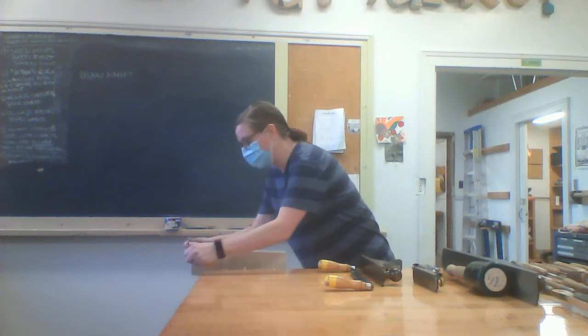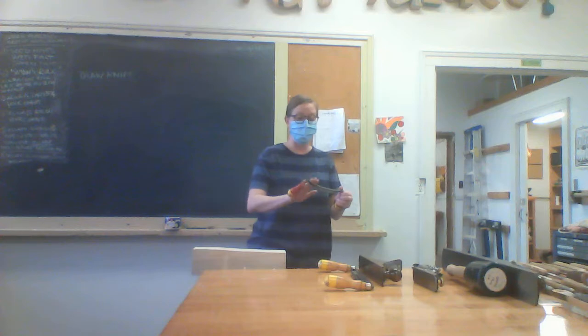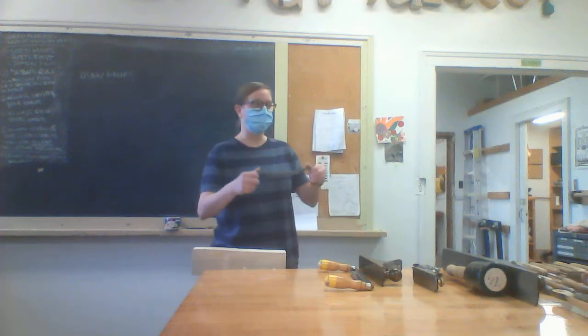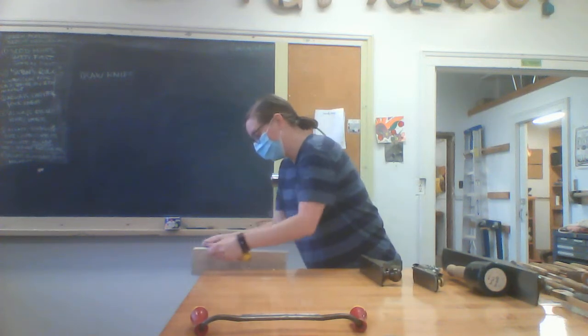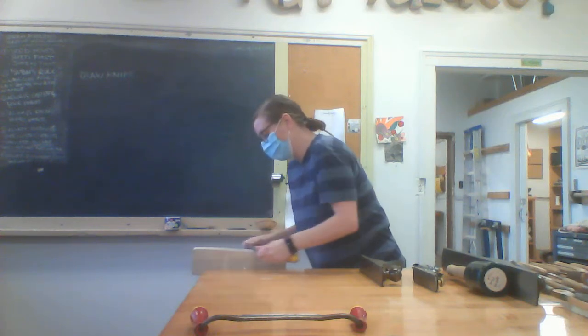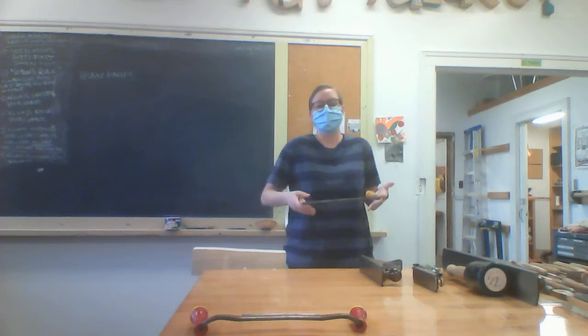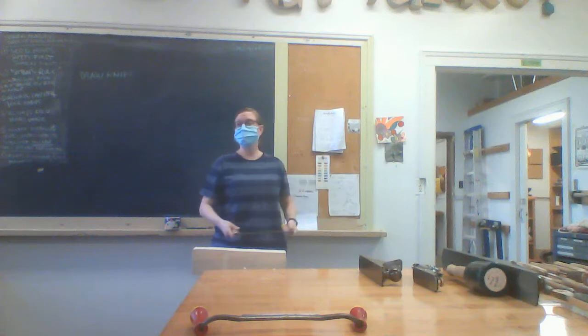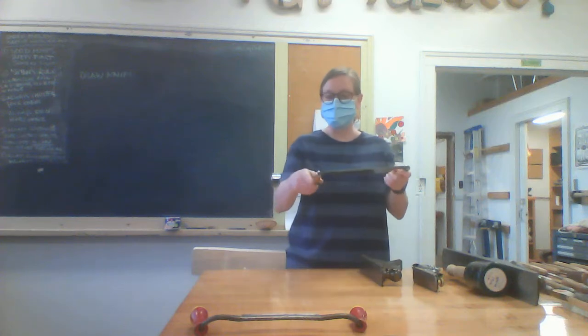How does it work? It works by putting both hands on it, finding an angle where it's going to engage your board, and drawing it towards yourself. This is another reason to leave extra material on your walls — because shaping is fun and you sometimes really get going with the tool and all of a sudden your wall is an eighth of an inch thick and you're like, oh no. But you can see how if you really catch a heavy cast at the front you can move a lot of material. I would use the straight one to strip bark and the curved one to shape a piece of wood.